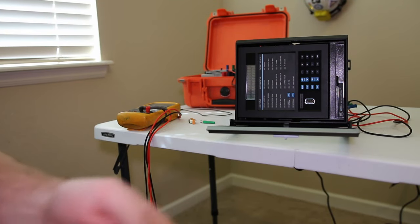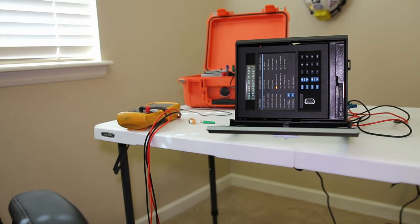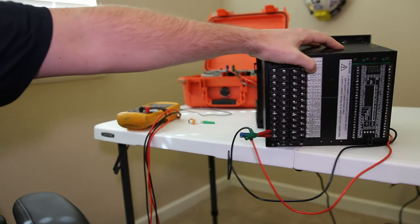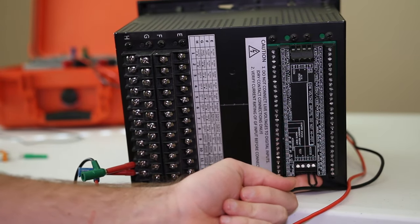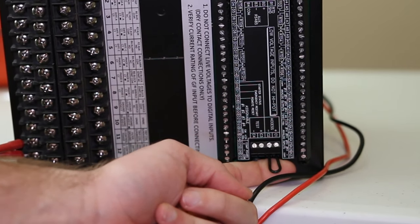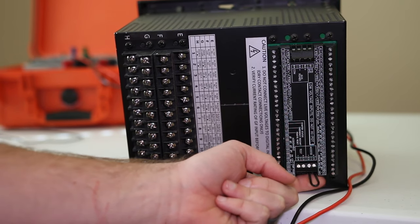Setup for this is fairly straightforward. Number one: the relay has to be powered on - it takes a second or two to boot. On the 469, there is a super annoying thing you need to be aware of: you need to have an access jumper installed right here between C1 and C2. If you do not have that jumper installed, no matter what you do, you will not be able to pull the settings out of it. If you think you're hooked up right and you're having issues, double-check the access jumper port on the back of the relay.